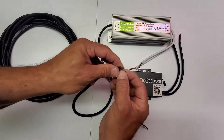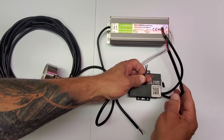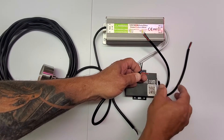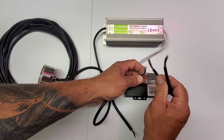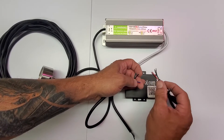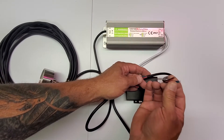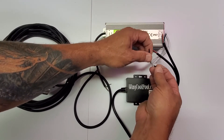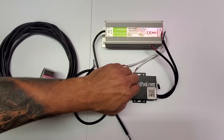Your light is going to have green, black, blue, and red wires — these are the output sides. You don't have to use both sets. You use one or the other, or both if you've got two or three lights. These wires are paralleled, meaning they're connected together inside — the extra wires are just for ease of install. Connect color to color: red to red, black to black, blue to blue, green to green. If you don't use the other set, cap those off and don't let them touch.